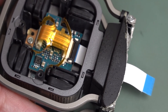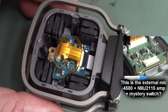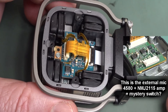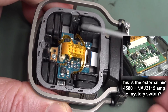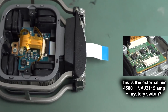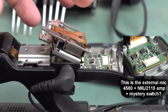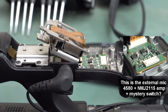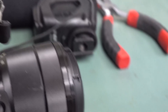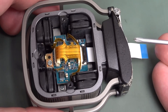I really need to re-watch my own videos before I do this. The preamp is inside there — so obviously the external mic comes into here and the switching is taking place in here. The external mic comes in, goes up here, and the switch is happening in here and then comes back out. Without the internal capsule plugged in, the external mic isn't working. A designer probably wouldn't have thought of the scenario where the whole head breaks off and the external mic should still work — the mux switch should be on this board up here. But for noise reasons you've got to have your preamps down in here, you don't want to run low-level mic signals all the way back.